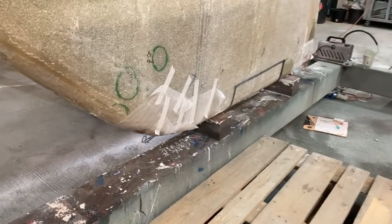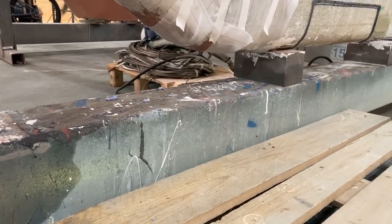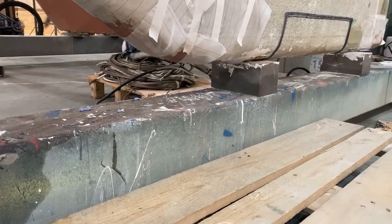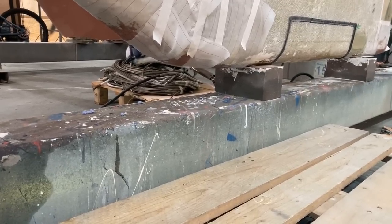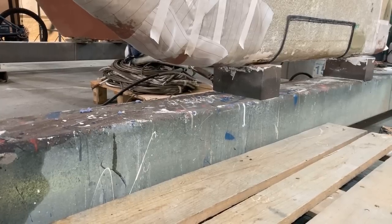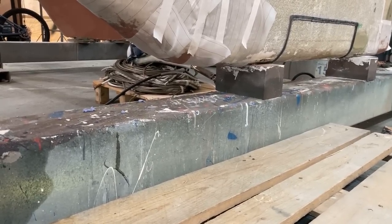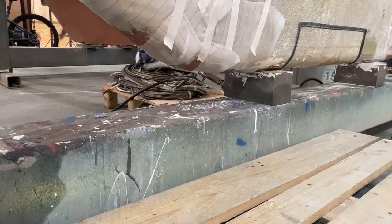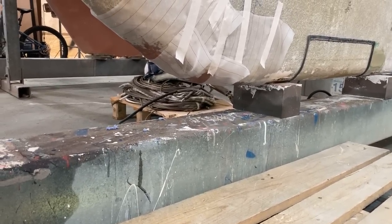I'm expecting it to exotherm a little bit, so it's going to warm up as part of its cure. But then that potentially makes it a little bit more runny, so there's always the risk that it's going to start dropping out the bottom of the repair. So a little bit of peel ply was easy enough to wrap around the bottom of the keel, and that should hold it there whilst it cures. I'll then almost certainly have to do a second fill on that just to get the levels looking half decent.